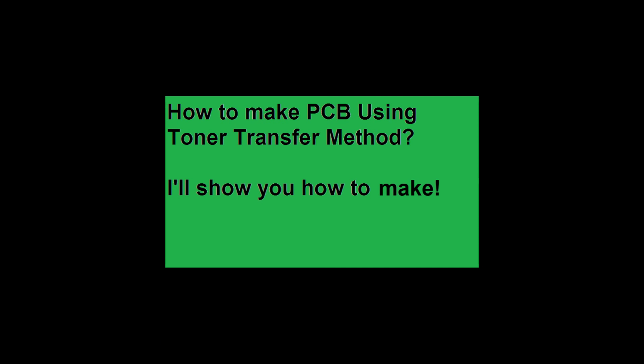Hello YouTube! Today I'm going to show you how to make a printed circuit board using the toner transfer method, in which you print your artwork on a photo paper using a laser printer. Specifically, you have to use a laser printer to get your artwork transferred on the PCB. If you use an inkjet printer, it won't work.